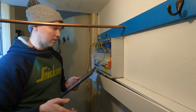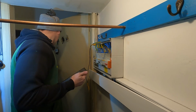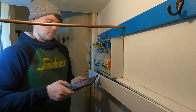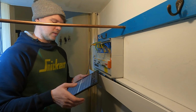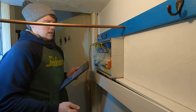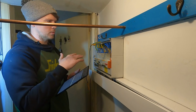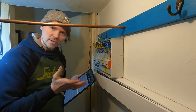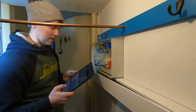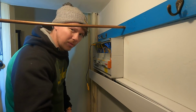It calculates it for you, but I know we'd rather, while we're here, it's easy just to do all the tests we can. And then upstairs, please, yeah? Upstairs socket. Once again, R1, R2, 0.30. It's coming out at 0.79, so we'll see what this comes out with. We've got breakers in here, but on the schedule I've just put spare. So as and when we need to update this, when we do the rest of the extension, it's quick and easy just to switch over. What are we saying? 0.70. So yeah, 0.79 to 0.70. They're quite accurate. Well, it should be, calculations.